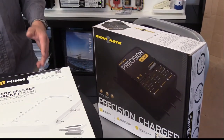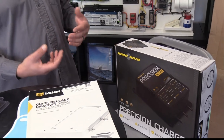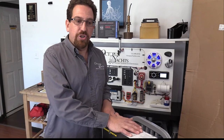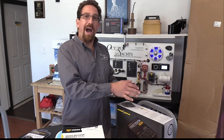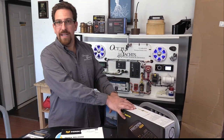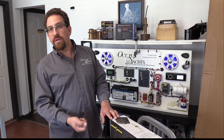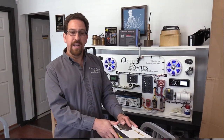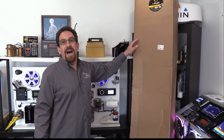Next we have our battery charger. This is one way to get the electricity that the electric trolling motor uses throughout the day back into the batteries for the next day. It's probably the most cost-effective option. I like a built-in battery charger because it's a lot safer than a portable battery charger and a lot more convenient — all the wiring is done during install to ABYC specifications, and when it comes time to charge your batteries, you're just plugging in a shore power cord.